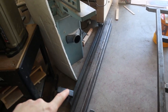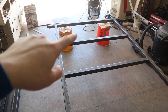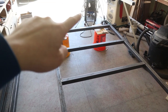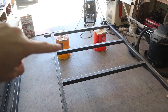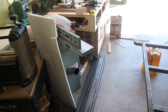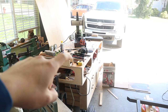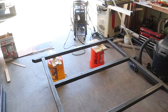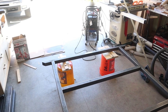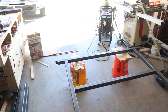I've got the three inch tube here that's going to be the main tongue piece, and then two diagonal pieces are going to be the two inch tube. The angles I need to cut on those are quite a bit more than 45 degrees, so my evolution saw isn't going to be able to do it. I grabbed some cutting discs for my grinder and I'm just going to have to do it the old fashioned way and hope I can cut them pretty straight.